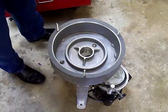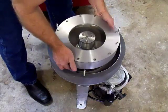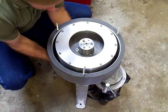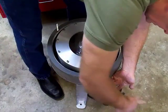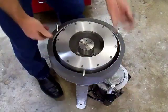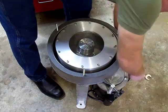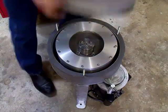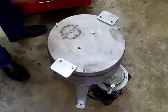Now to put it back together is very quick. Put the spindle back down and push — you see it's a nice tight fit. Pull the belt back on, tighten it up with tension, tighten the motor mount bolt, put the lid back on, and we're ready to go.